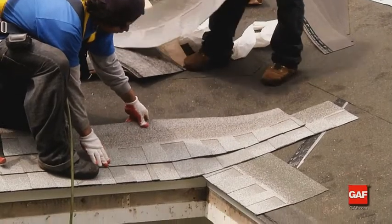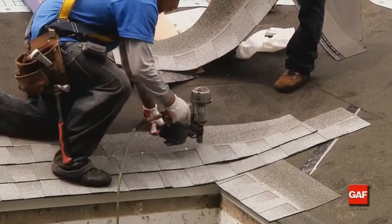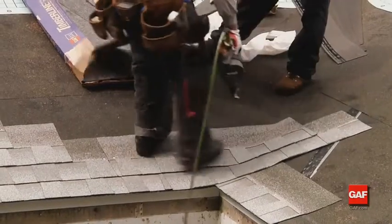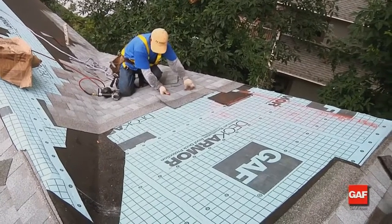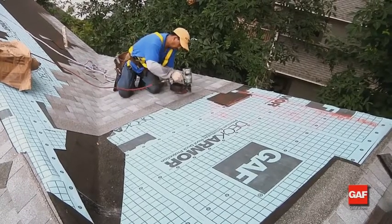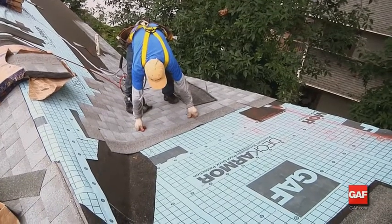The first course is the only course that is woven with the intersecting roof surfaces. Now, apply shingles, assuring that you extend at least 12 inches past the intersecting roof. Don't make a joint in the valley. If a shingle falls short, insert a 1 or 2 tab section or 12 to 18 inches of laminated shingle in the row so that a full shingle extends over the valley.